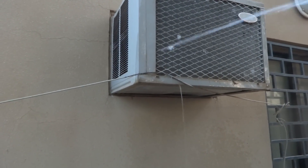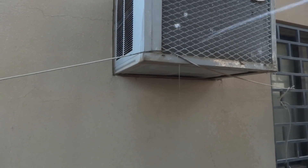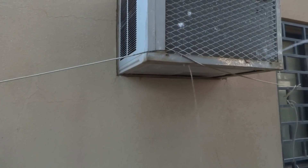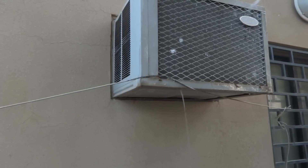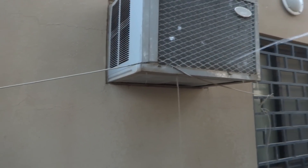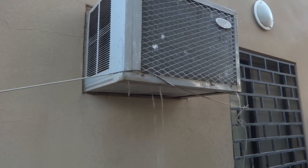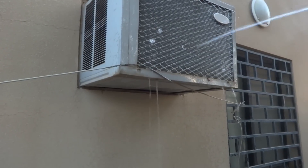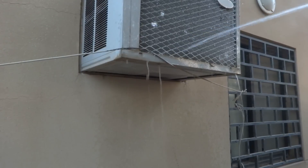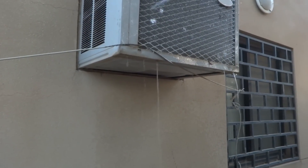This will increase the efficiency and decrease the problem the air conditioner is giving. What I am going to do now is pass this hose pipe to inside the bedroom and wash the evaporator, which will still be dusty with debris. That is also required so that it will release the heat, and the air conditioner will no more go to the high pressure state.